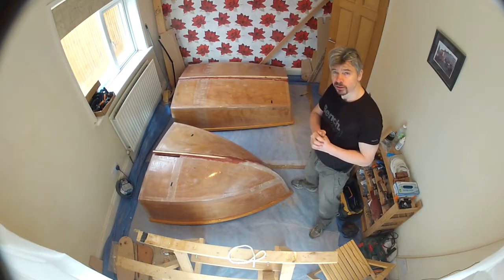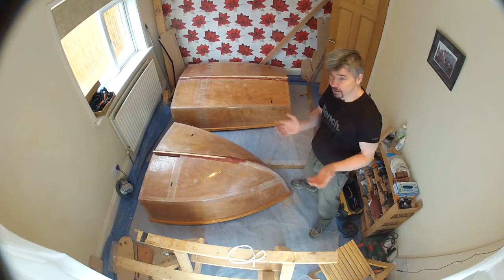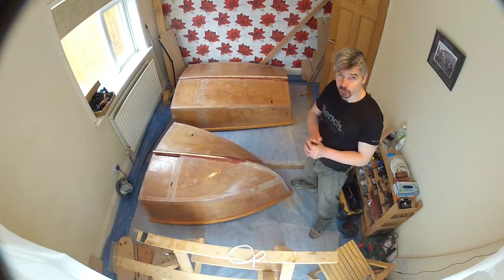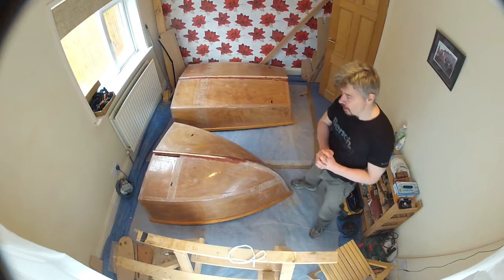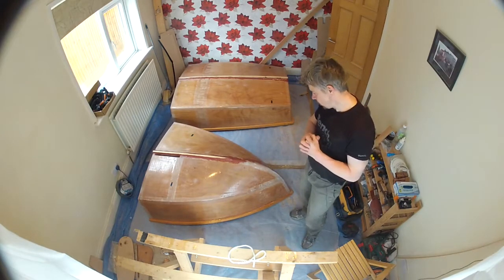It's actually soft to put my nail onto it. It's going off, but just very slowly. I guess it's been cold overnight, so it's been too cool, I think. So my plans to get that sanded and then epoxy the keel today isn't going to happen. So I'm basically going to need to do some other little jobs.